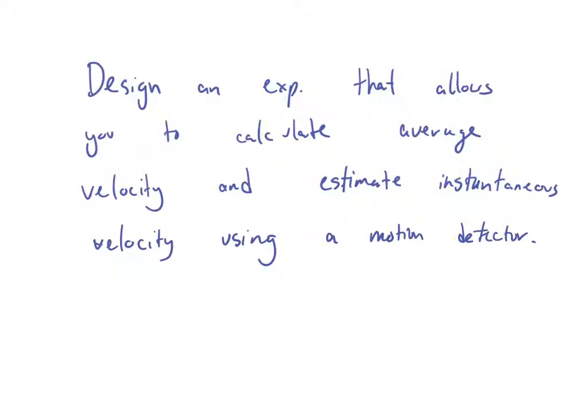Now, the motion detector itself is here. It sends out a sonic pulse every time. The time it takes to get back is measured based on the speed of sound, and from that it calculates the distance the object is away. The idea is that the speed of sound is a constant, about 340 meters per second. Now, in the actual lab device itself, the distance should increase as I move away. When I'm here, it should say 0. It's pretty close, it's not exact.